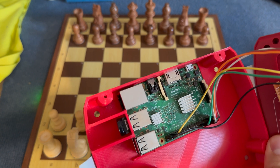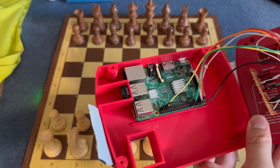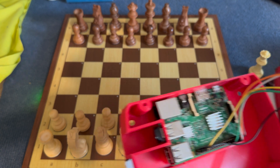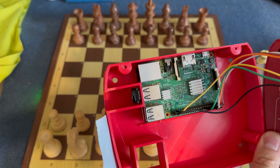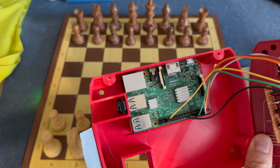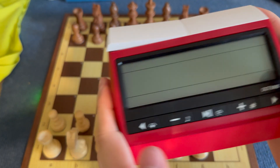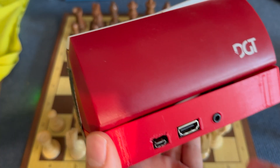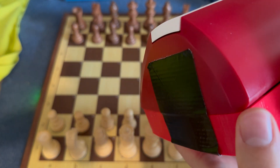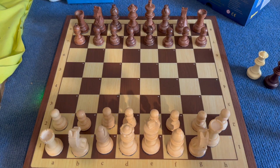You need at minimum a Raspberry Pi 3B, though it also works with a Raspberry Pi 4 which has a lot more horsepower — you can even emulate graphical chess engines with Wine on the desktop. With a Raspberry Pi 3B with one gigabyte of memory, you can only use the web interface via an external computer. There's also a breakout for audio and HDMI if you want an external monitor. I'm currently powering it with a power bank.